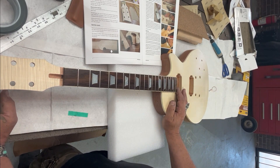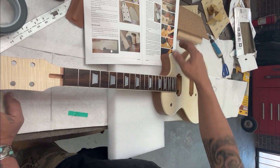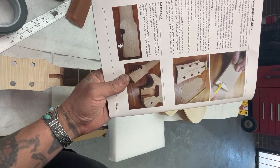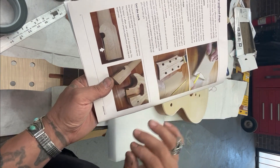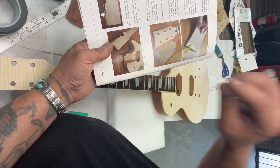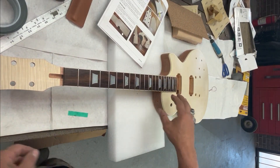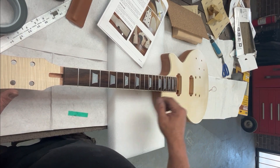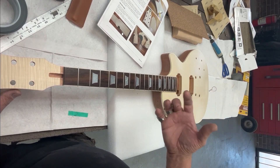By looking down it, everything seems like it's going to line up well with the humbucker holes, but we'll see once we string everything up. I cleaned up inside the cavity — I went in with a razor blade and squared the corners up really well because there were fibers left over from machining still connected. I tried not to dig into the wood too much, but wasn't too worried since glue would seat everything down anyway. I also didn't sand down inside there — I wanted that rough texture for the glue to really get into the fibers for a good strong hold.